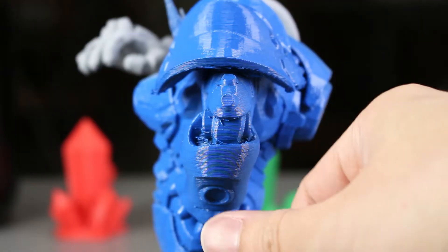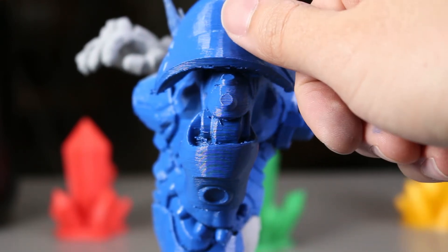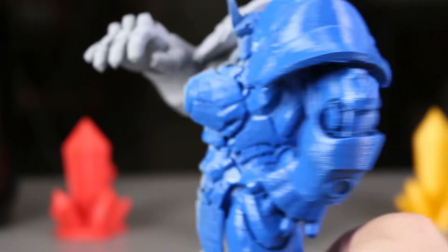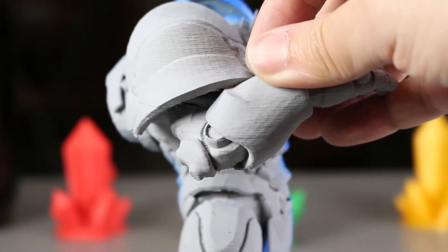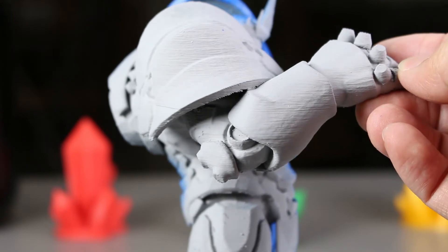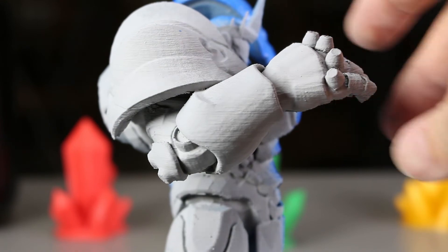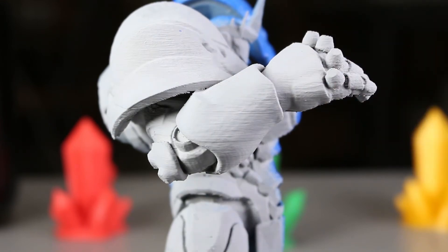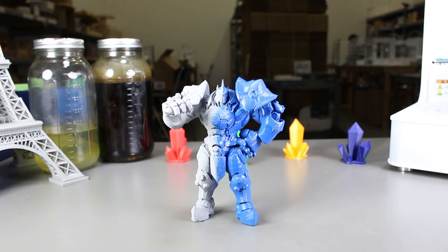The next is the sidearm. The lines are really prominent here with the acrylic paint, while the primer side is a lot more smooth and the lines are less apparent. If I remember correctly, I sandblasted this arm a lot more. I want everyone to remember that the media we used in the sandblaster was actually old media, and if it was swapped to new media, the results will be a lot more effective and apparent.